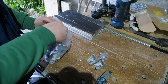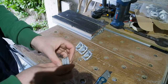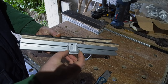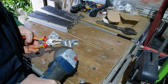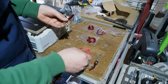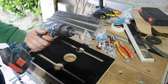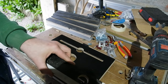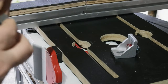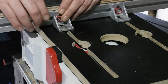One of the things holding up this build were the corner brackets — the nice black ones I ordered from China are delayed due to new year holidays. In the meantime I found a bag of 25 on Amazon for £18 with next-day delivery. They have little guide tabs to locate in the profile, but as I'm using them perpendicular I ground those off. For the cam levers, I'm scrounging from cheap bike seat post clamps. I also drilled two 30mm holes in the center of the slots — this allows me to take the profile assemblies on and off without unscrewing the T-nuts completely. I set the brackets at a distance to allow fixing across as well as along the slots, giving more options.